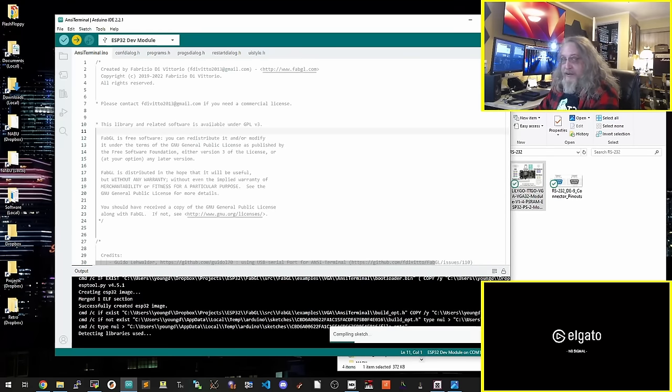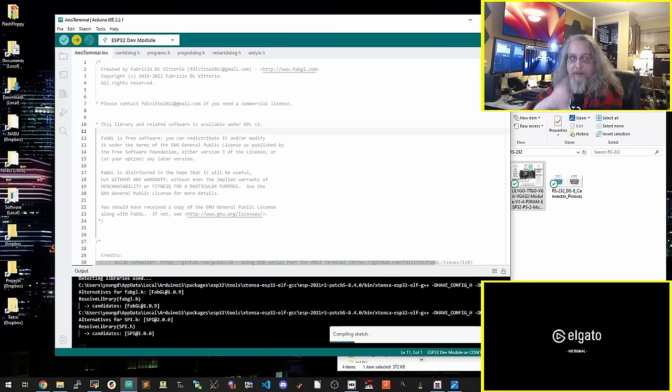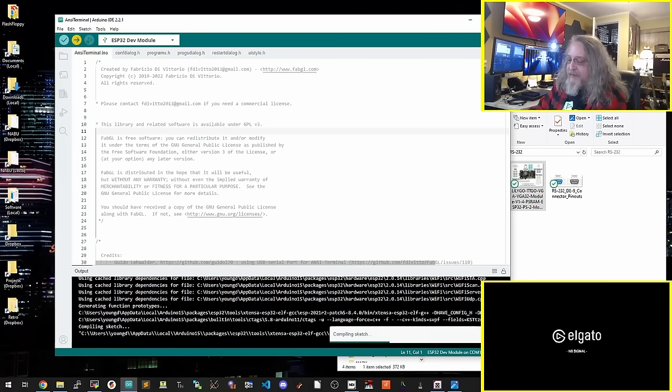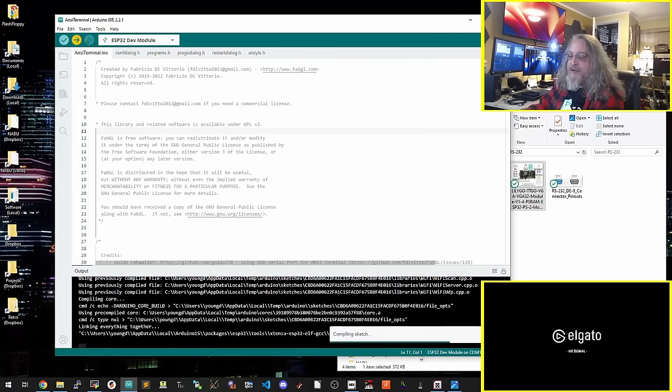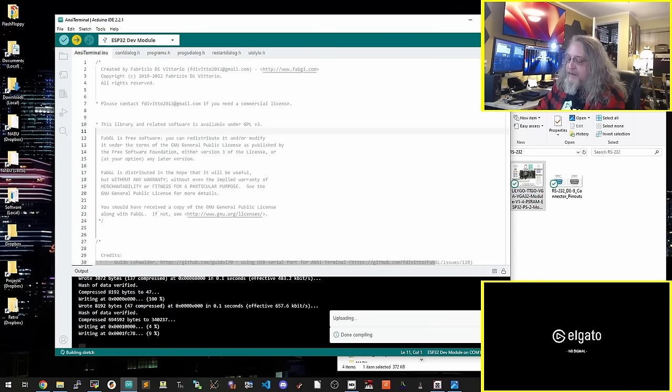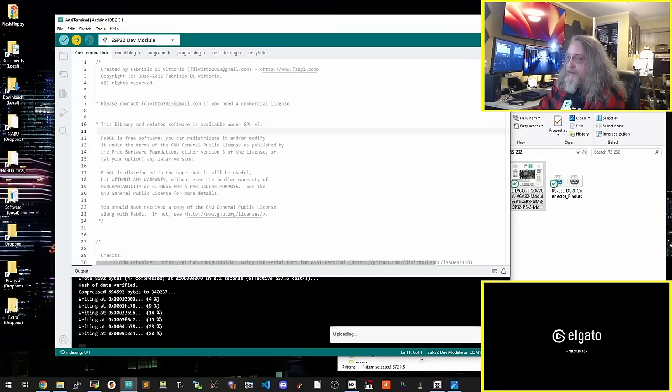Right now, I am connected to an HDMI KVM that runs into an Elgato capture board. I did have issues with various HDMI or VGA to HDMI adapters. This is the one that I found that works with this board, and it works really well. You do have to supply USB power because it is coming out HDMI, and the VGA doesn't supply power to the adapter. So you have to do that. In this case, I'll try and include links for this stuff, but it is on Amazon. It doesn't say who the maker is on it, unfortunately. I'll have to find the link. But we'll connect that up.